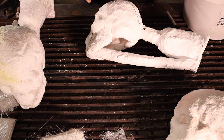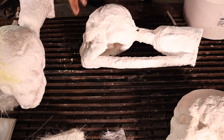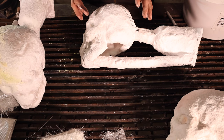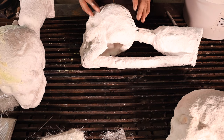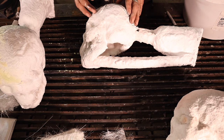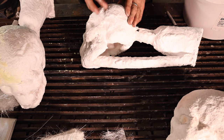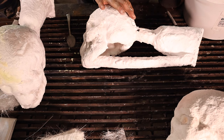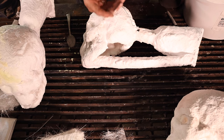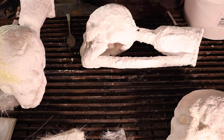Since the Green Patch is a heat-set refractory, I'm going to do just that. It will air dry, but it sets up just a little bit better under heat. A lot of people will apply it to a cold shell, and then take a torch to it to try to set it. The problem with that approach is you'll seal the outside surface of the Green Patch, but you'll be trapping all the moisture inside. If you go into your kiln too quickly for your preheat, your patches will actually pop off the shell.